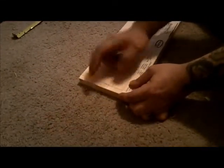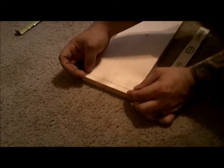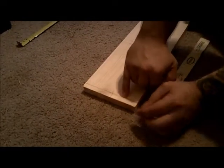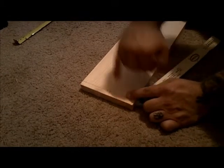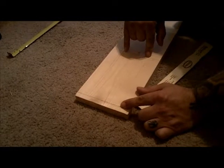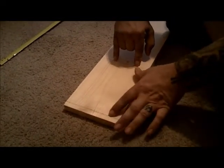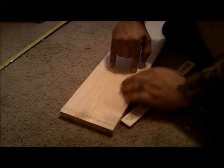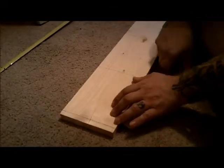This is the half inch, because it's the top of my cage, top of my rack. So this is where that piece of wood is going to sit and screw into. And then from this would be the bottom of the plywood. From there to the top of this piece of plywood, my first line, is going to be 7 1/4 inches in between. And that's going to allow me the 7 1/4 inches I need to put my tub.